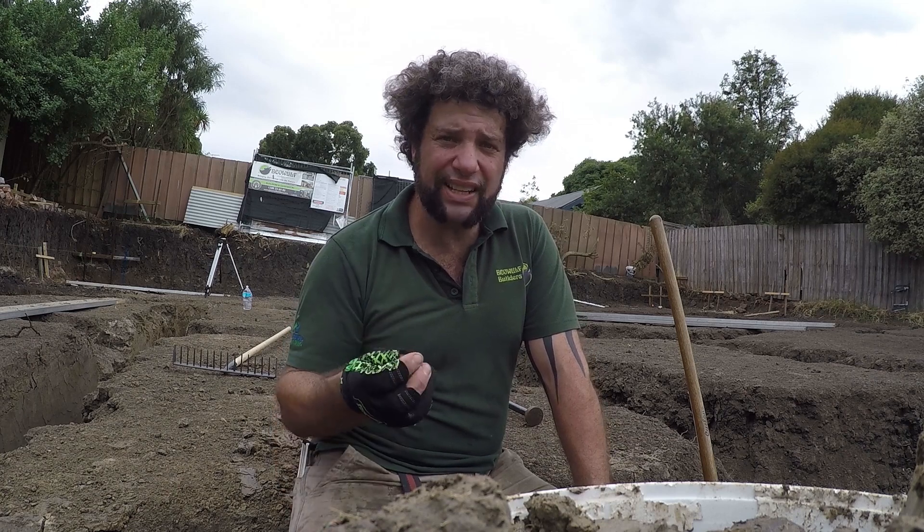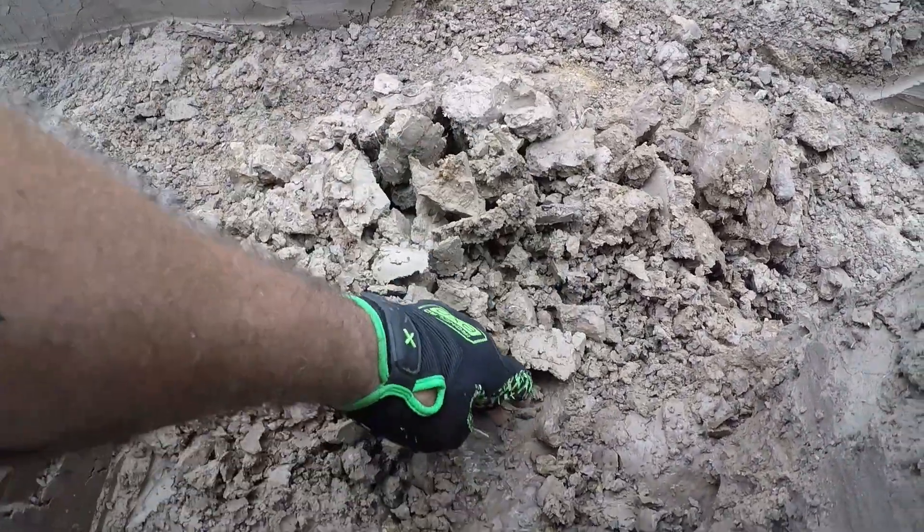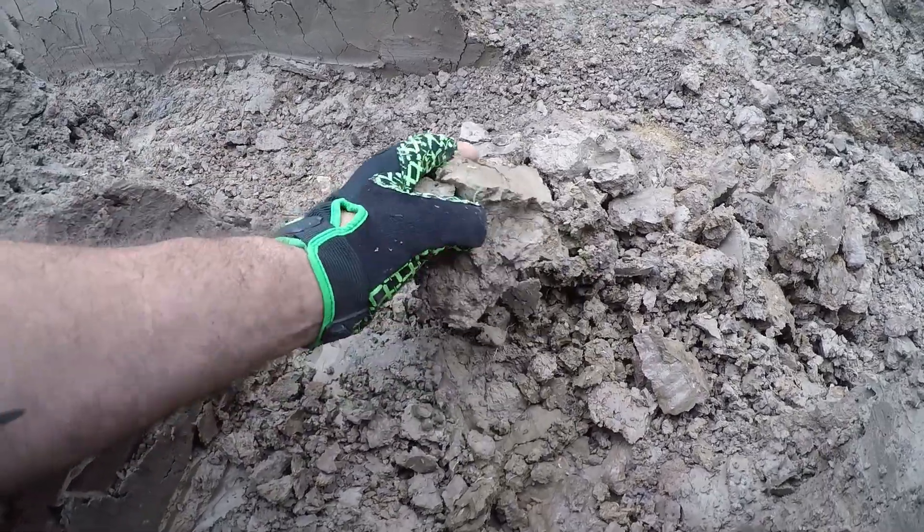A waffle slab just sits on the ground and doesn't get cut in. Today we're doing some strip footings and I'm going to show you, just in this tiny area, the different types of soil. We're clearing out the concrete beam areas as we dig. Some soil is super shaley — it breaks up really quickly and easily. Check this out: I've just stuck the shovel in here and this is breaking away like nothing. This soil is just peeling up, so it isn't going to be very stable for foundation work.